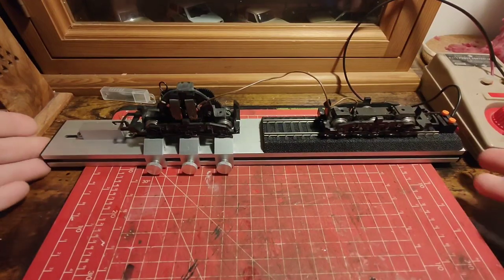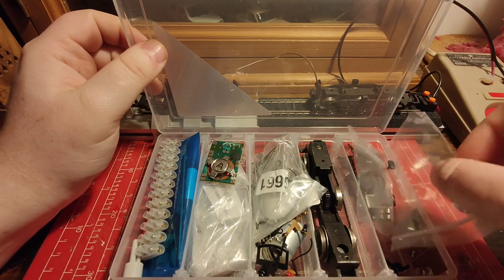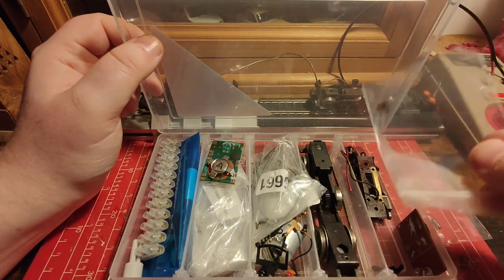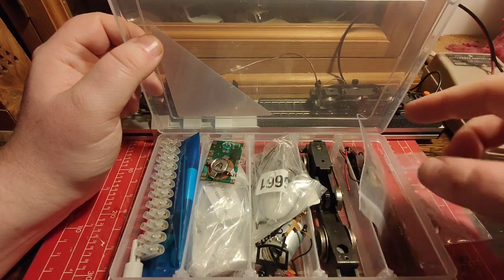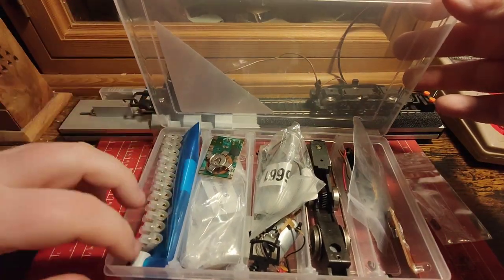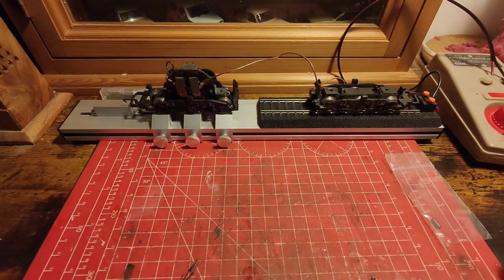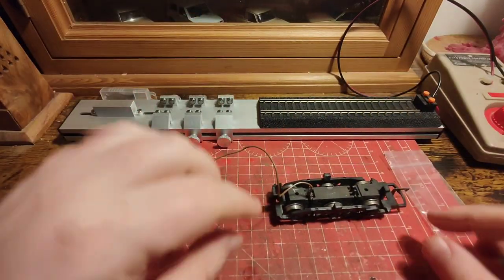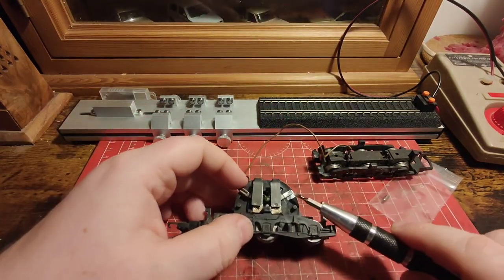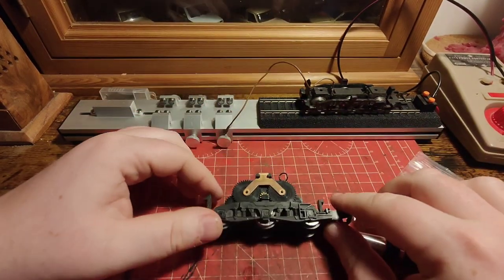There has been an adjustment. One of the first things I need to do is get out some new carbon brushes, which I'm going to have in this box of random odds and ends. It's got odds and ends to do with everything model railway — X03, X04 motor parts, a buffer for a Class 66, pulsing LEDs, set of batteries, a chassis, valve gear bits for a J15, chocolate block, potentiometer extension shafts. Always handy to have a box of random bits as a modeller. But we've got the carbon brushes out. This wire is just fairly standard, connects to both bogeys. You can disconnect it from either side you want, but it's disconnected from this flat connector here. Let's put that to one side. The wheels can be cleaned on that because it does act as a pickup, but we're mainly bothered about this Ringfield motor.